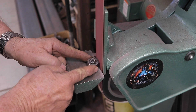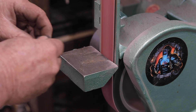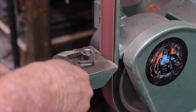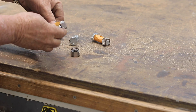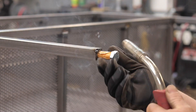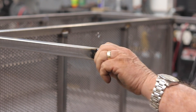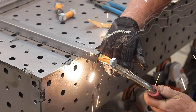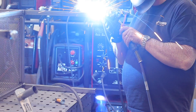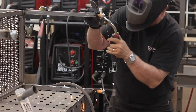Now here's the leg adjustment solution I was talking about. This is a half-inch nut — I wanted to put it inside the square tube, but it didn't quite fit so I had to do a little grinding to knock a couple of edges off. I put a half-inch bolt in there, then put some tape on the threads so that when welding in place I wouldn't get any spatter on the threads. I put a couple of little tacks in each corner plus a little filler material on the sides, then took the tape off — and there are the adjustable legs. The surface this is sitting on is really uneven, so this is going to work out great. I repeated that with the remaining three legs.